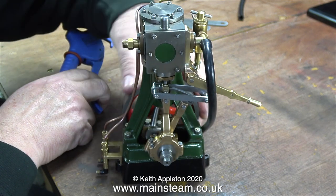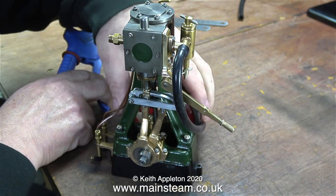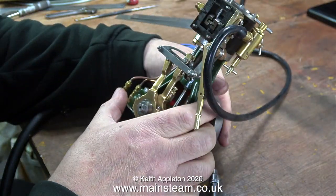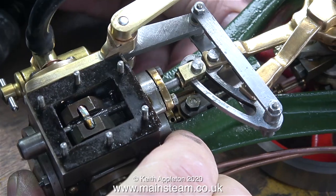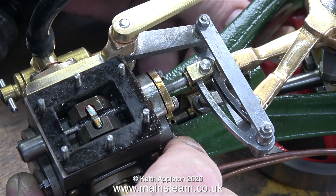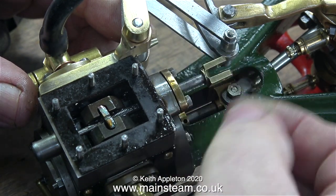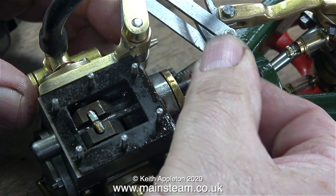I loosely refitted the cover with just a couple of bolts to see what happened — and not a lot, as I hadn't touched the adjustment of the eccentric, which was miles out. For a second time I removed the steam chest cover to have a closer look at the valve events. I'm double-checking the valve events, and yes, everything is fine in the valve chest. The driving block that moves the valve is a bit wonky — I think it's just been threaded off centre. As you can clearly see, it is not a tight fit in the slot in the valve, because it doesn't need to be. It's steam pressure that holds this valve against the port face, not the block.